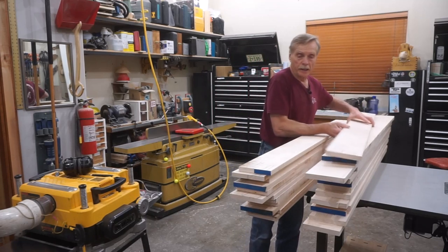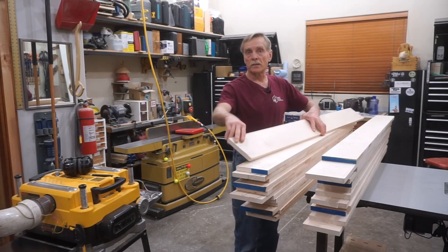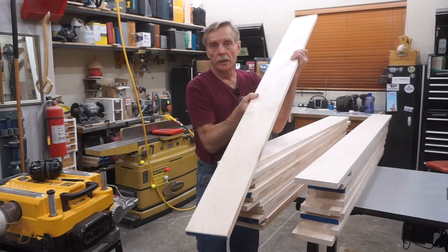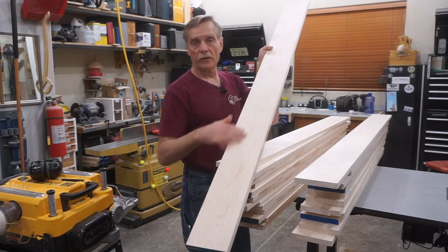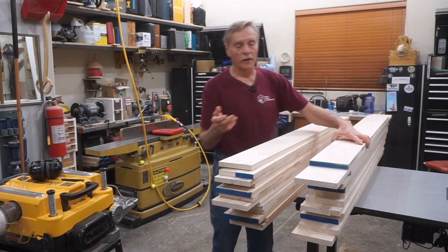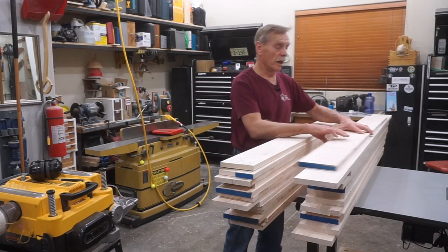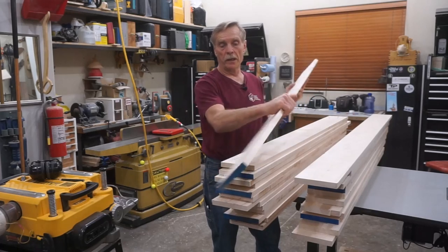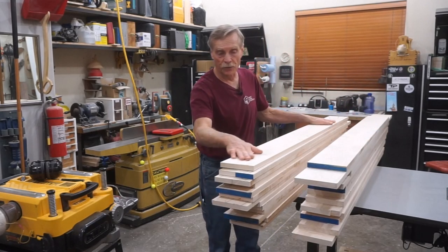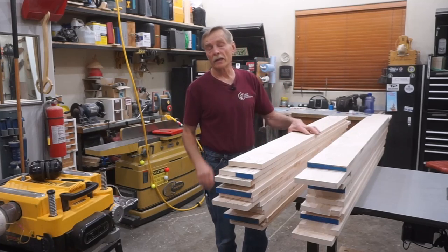I'll keep after it going a thirty-second of an inch at a time until all of these faces are cleaned up. On the stack where both faces are already clean, I've flipped pieces and I'll keep planing off the B face — even though that's the face I ran over the jointer — but in this case there are stains. It's kind of a finer point: because this wood gets painted, a blemish doesn't really matter. But when the millwork is going to get stained, you can have a good face and a bad face, and if you plane long enough on the good face you'll end up with two bad faces. I wanted you to see how this thickness planing process progresses so you have an idea what to look for when making next level millwork of your own.